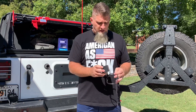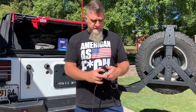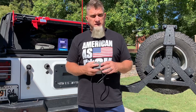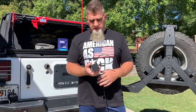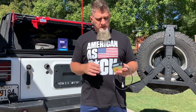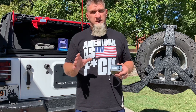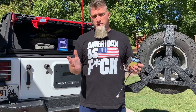One more thing: I read that you want to be below 1.5 on your SWR, but the instructions that come with this antenna say below 2.1 — so do your own research and see what works best for you. I got both my low and high channels under 1.5; the lower you can get it, the better your signal and the less power loss you'll have. Hope you enjoyed the video — leave a comment if I missed a step. I'll also leave a link on how to properly mount your antenna. Make sure you like, comment, and share. Thanks for watching.